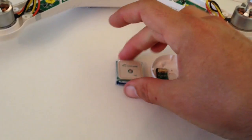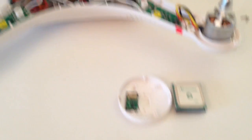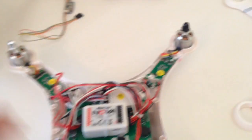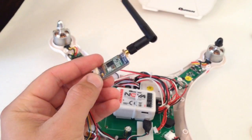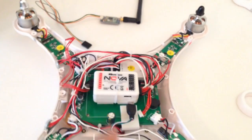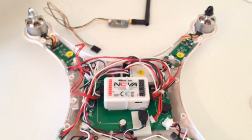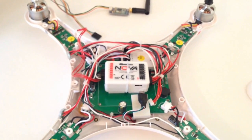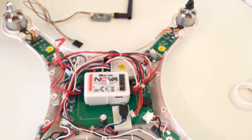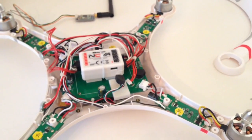It would be an upgrade to get a GPS-magnetometer combo and put it in this unit, though I doubt some of them would fit and you might have to do some modification. One major downside inside this box: there is an I2C port, so you can use something like a telemetry unit, which APM is really famous for. These telemetry units are fantastic for updating waypoints and modifying PIDs on the fly. The downside is that I2C port has no external extension, so you have to actually crack the case open and solder the four points for the I2C connection. That's pretty annoying considering nearly every APM board made so far has at least one open I2C port. At least it's there in the PCB design. I'll probably do a video where I crack the case open and show you how to add telemetry to this thing.